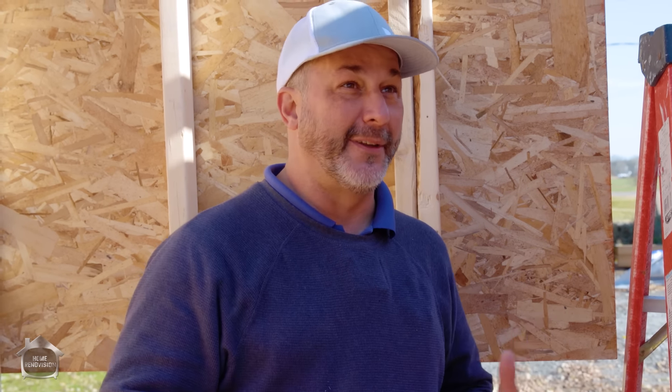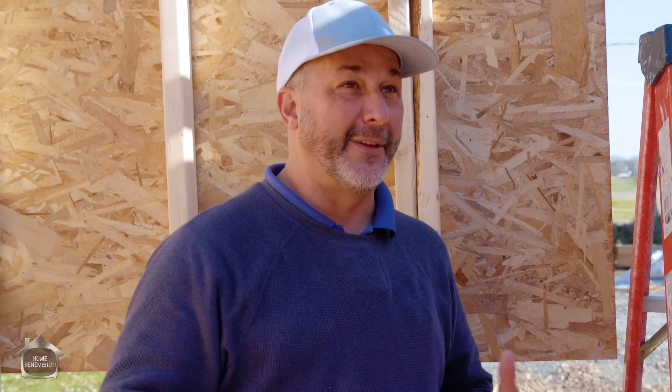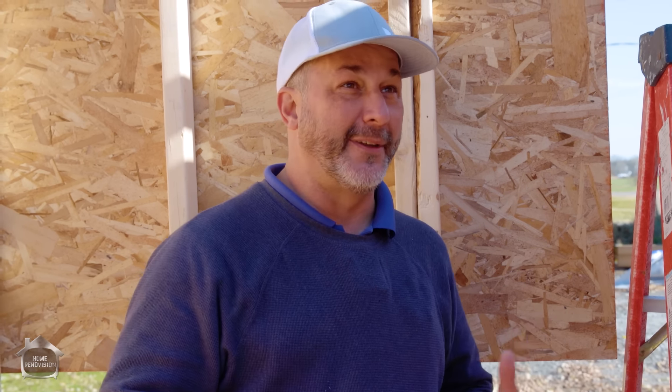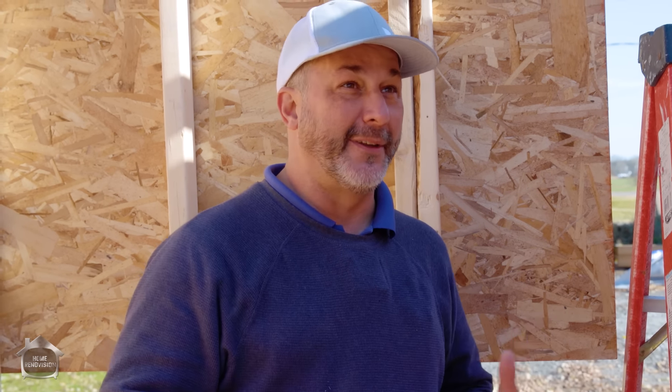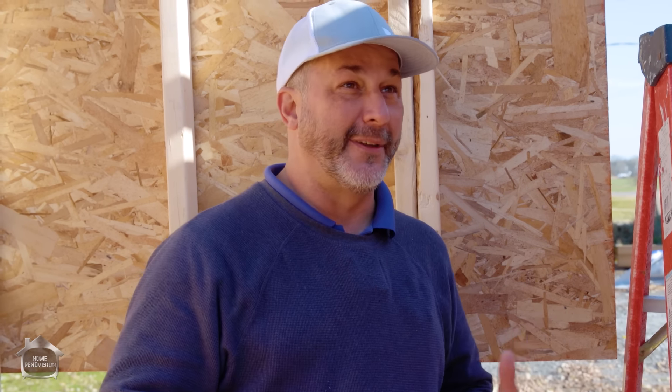Because it's pretty much what we're going to call a flat roof, you've also got to use an ice and water shield — it's self-adhesive. We did that same process in the last shed video. The only difference is in this video we actually put the same roofing shingle on top, and it goes on real simple — stagger your joints and install it according to manufacturer's instructions, 5 nails per shingle. Now the roof is on — it's just about buttoning it up and finishing it up.